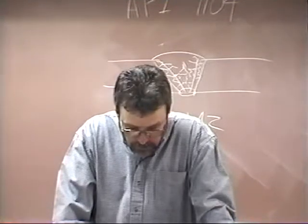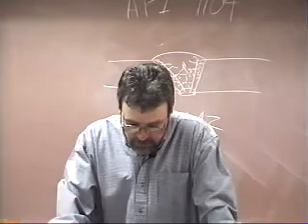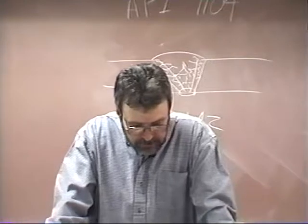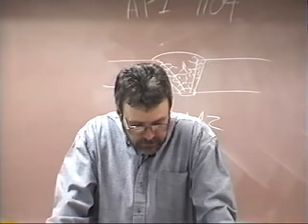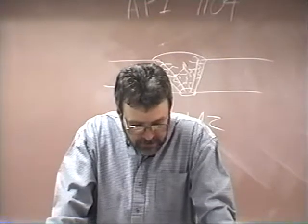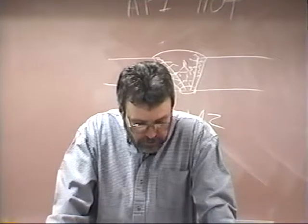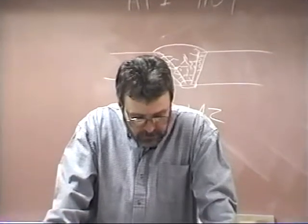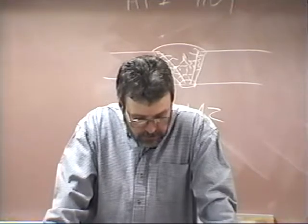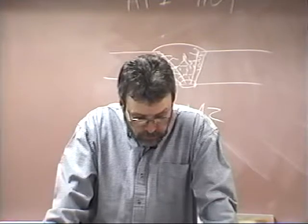Extremely important. As soon as sufficient metal has been built up to bridge the gap opening, he must begin to move the electrode by sliding its end in the groove, constantly maintaining a slight pressure on the end of the electrode to keep it buried. The electrode may have a tendency to stick as it is dragged along in the groove, and if this occurs, the electrode holder should be wiggled slightly while keeping the end of the electrode buried in the groove. A small keyhole will form behind the electrode, and this should be watched as the weld progresses, as well as the molten pool of metal.